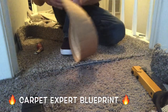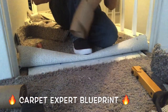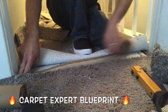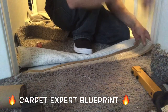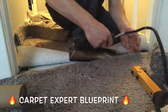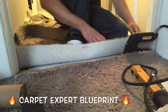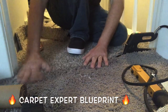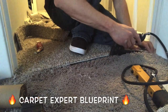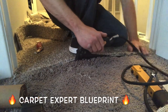We're going to unroll the seam tape and cut it about four inches hefty. We're going to peel back the new carpet, take the seam tape, and fold under the edges on each side just so it bumps up on the tack strip on the door jambs just a little bit, to make sure the tape burns evenly. Drop the seam iron in there. Everything's going good so far. Let that iron sit there for about eight to ten seconds, and we're just going to take our time and let it slide an iron's length forward nice and easy to get a good even burn on that seam tape.